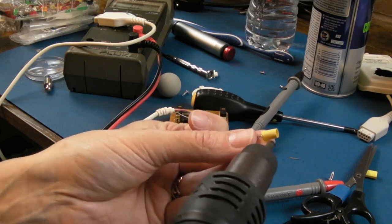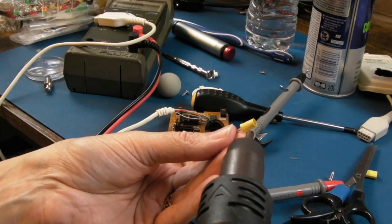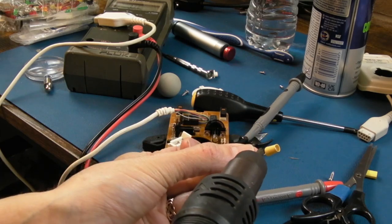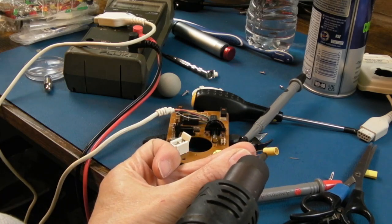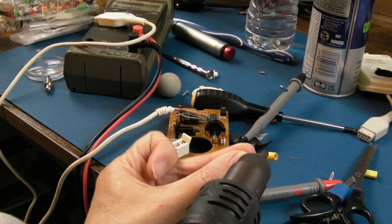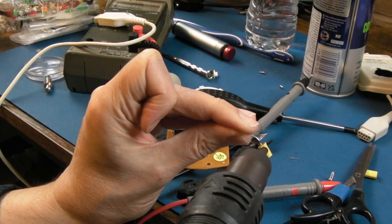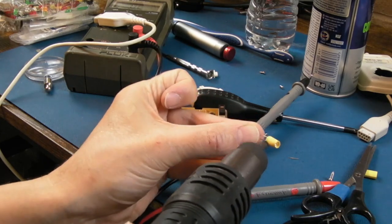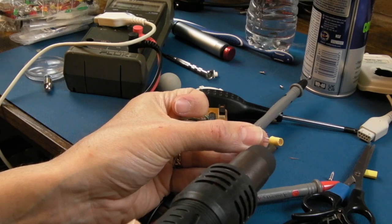And of course you could go with something smaller. You could go with a 3mm LED here, then you'd have to do a lot less work in terms of heat shrinking and faffing around probably. And you can get SMD ones as well. You could get really creative and have a little PCB design to mount a single SMD LED that has some solder points for some wires.